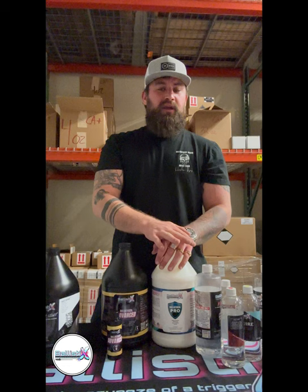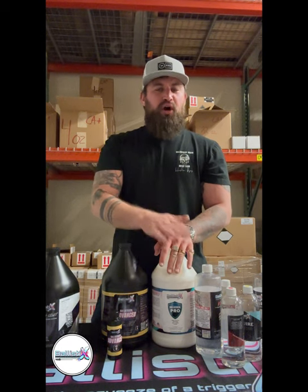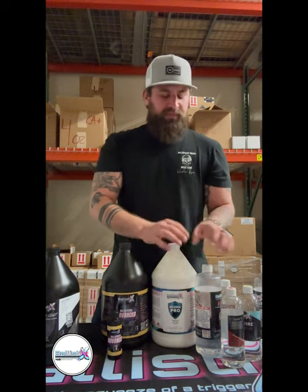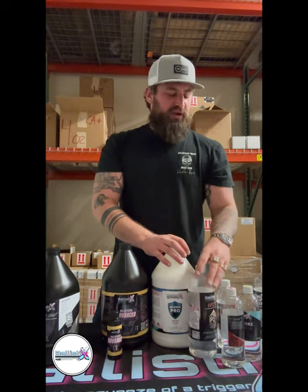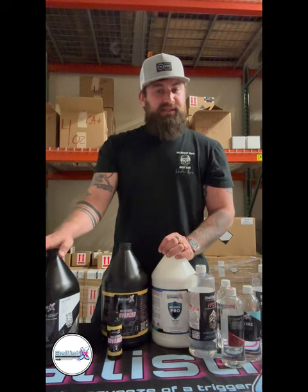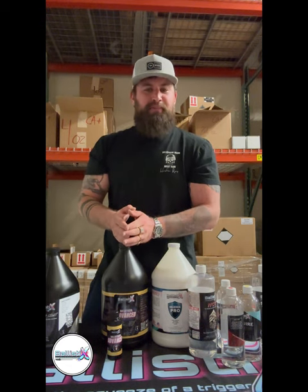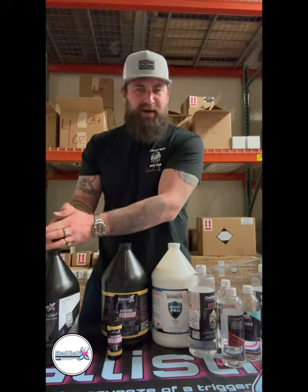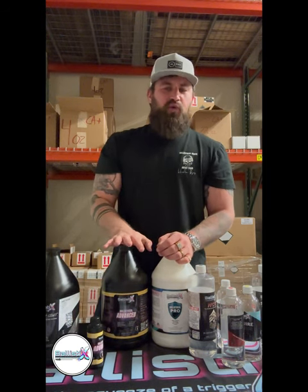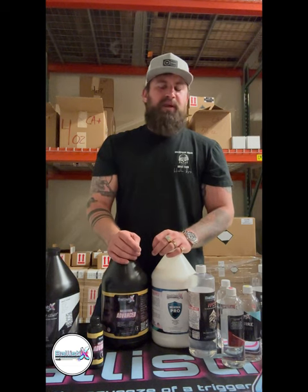You'll notice the biggest difference is the white or clear bottle versus the black bottle. The clear bottle is our pro system — BallistoSeal Pro. This product can be dipped and rolled or sprayed and rolled, and immediately upon drying you can use our NCO or Squire right over top of it. You also have the option to put the Stealth Coat or Squire 2.0 over this. The black bottles are meant to be used with the black bottles. BallistoSeal Advanced is a two-part product — simply dump the B into the A. It can be dipped and rolled or sprayed and rolled. Typically both will take one to two coats depending on the porosity of your slab.